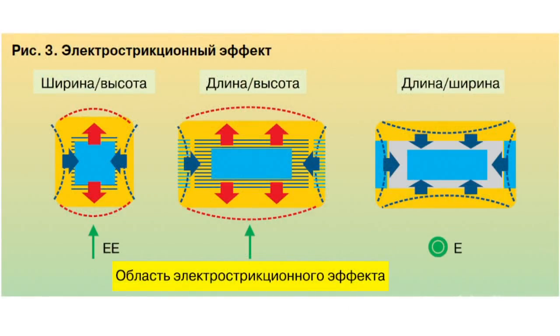All dielectrics can sustain the electrostrictive effect. When AC voltage is applied, a capacitor stretches and shrinks in different directions. Mechanical deformations and stresses are accumulated at the edge of the capacitor's external electrode. If the applied AC voltage is too high and the material has strong dielectric properties, cracks may potentially occur under the external electrode, which results in short-circuit and breakdown.